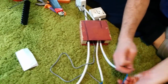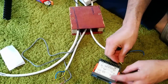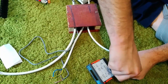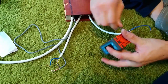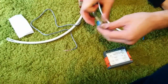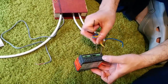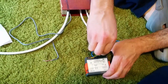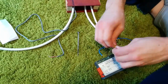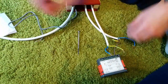We'll start off by connecting the load of the cooler to connection number one. Make sure these are very tight and that the wire is not sticking out. We'll do the same for our heating outlet — connect it to connection number three, leaving the center one empty for now. Then let's do the ground — actually, let's do the ground now.